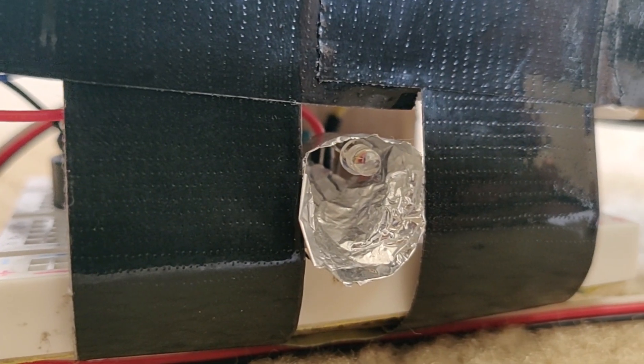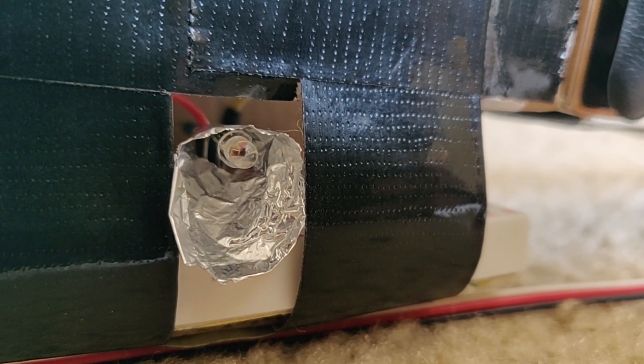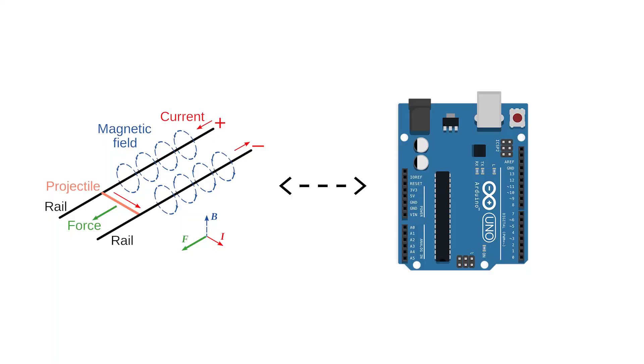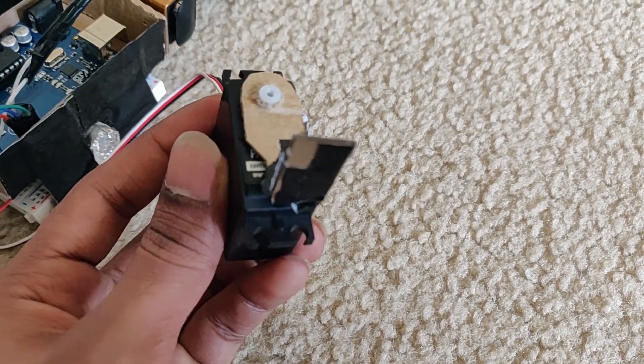For the tripwire circuit, I used a phototransistor with a foil cone to detect the laser pointer beam. I also wanted to isolate this circuit from the railgun, since the railgun operated on high currents and very low resistance. I needed something to control the railgun using the Arduino, so I created this motorized arm to release the projectile onto the rails.